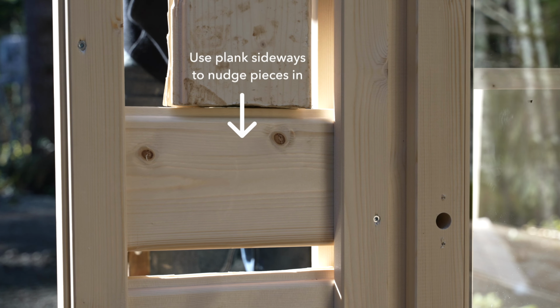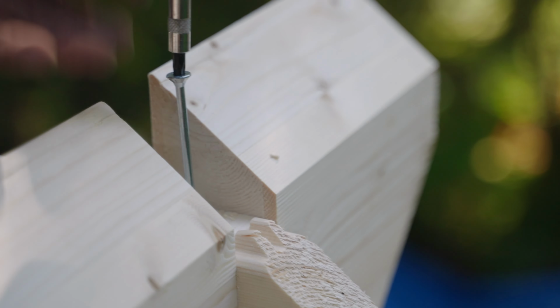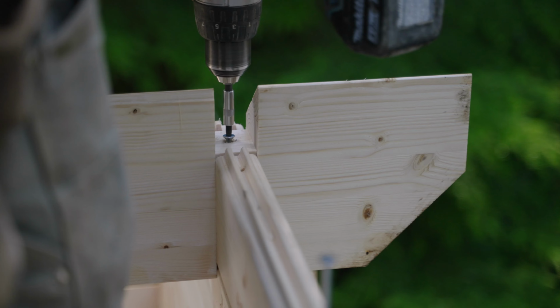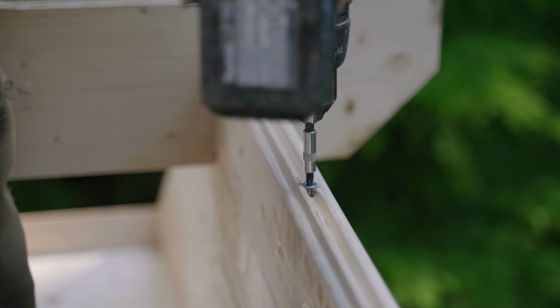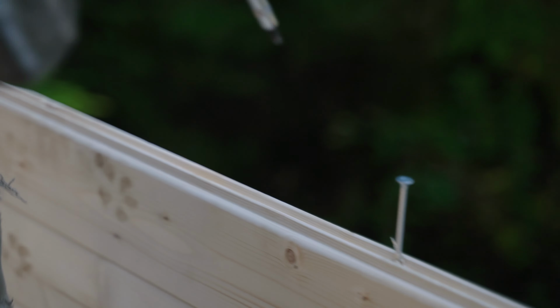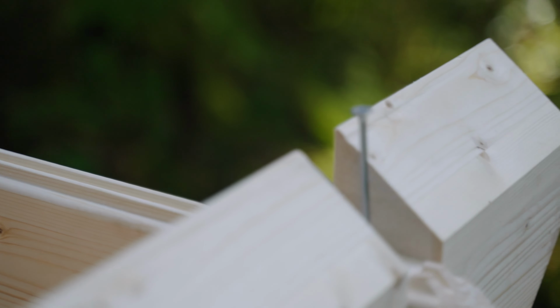Install rafters in correct notches and screw down onto top wallboard. Place on gable piece and hammer tightly into place with your hip block.